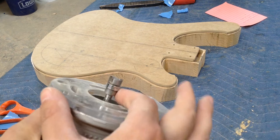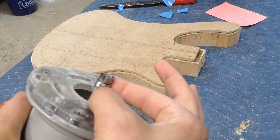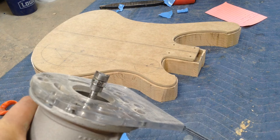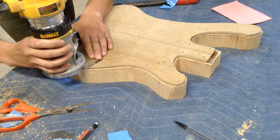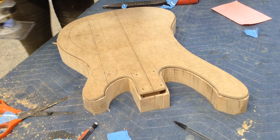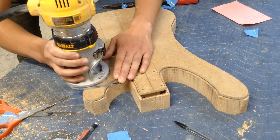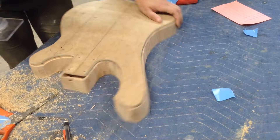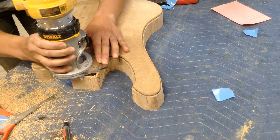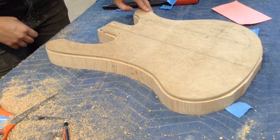I put the double-sided tape on the pattern. This is the bit I'm using — it's basically a small cutter, 3/8 inch, and then there's a bearing. That bearing will ride along any profile that you have and copy that profile with the cutter onto the wood. It's a nicer brand called Whiteside, which I got on Amazon. This 3/8 inch bit is nice because that bearing will follow this quarter inch pattern. Some bits have a cutter head about an inch and you need to make your pattern out of something thicker like three quarters of an inch, so just think about that if you have to start buying router bits.